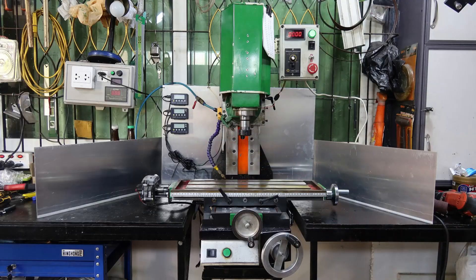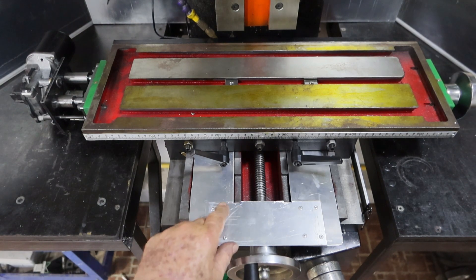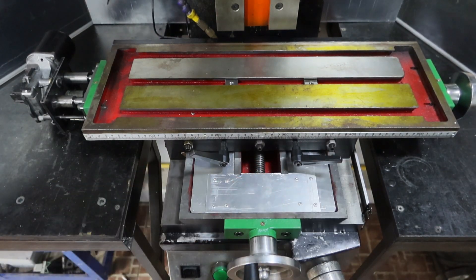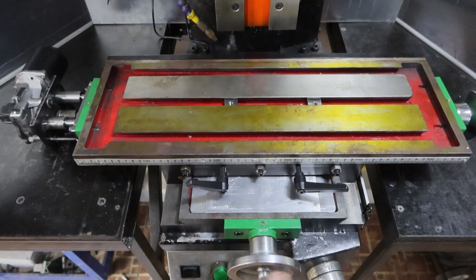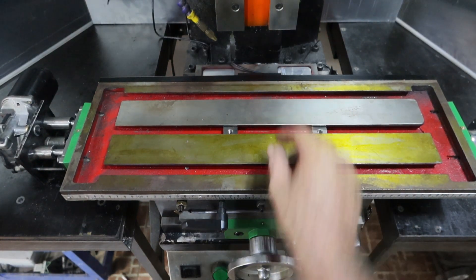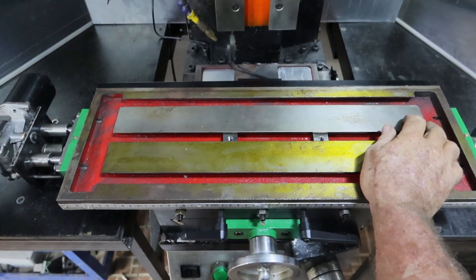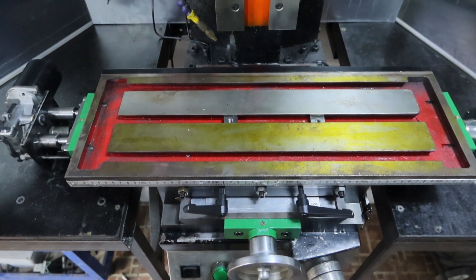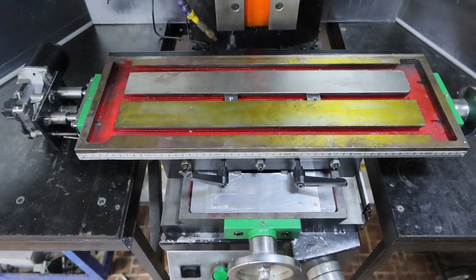As you can see I've made up the new splash guards to get rid of those silly bits of corrugated stuff I've been using for ages. The sides could have done with being a bit higher but those two sheets cost more than I wanted to pay — I cut them at one-and-a-half to get two sides. I also made this piece that just slides up in there and drops down into the slot to keep the bearing covered and stop these two slots from filling up. This comes back over the top of it no problems at all, although the nut for the lead screw eventually hits it when I get out to full travel. If I ever needed more travel I could cut a notch out of it, but I'd rather leave it as it is because it keeps the lead screw covered.